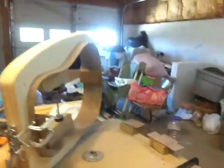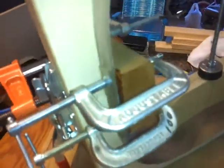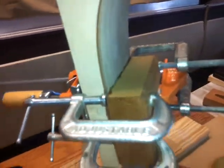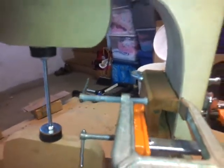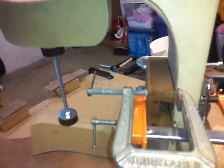And let's get a look at it. See what it looks like. Down in there. Some pretty good squeeze out. I think I put more glue this time than the back, but that's okay. You don't want to go too slack on the glue. You can squeeze out, and especially the neck block, because of the lack of wood material, glue into the sides for the dovetail. This would be a dovetail neck.